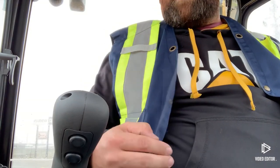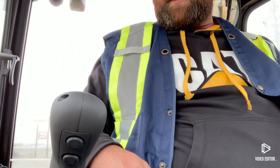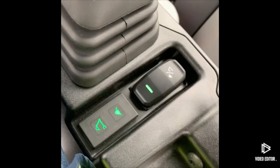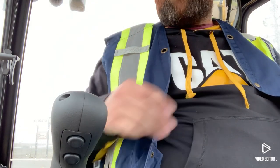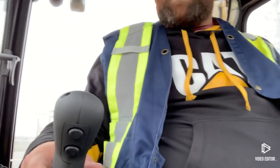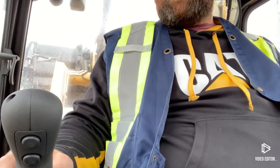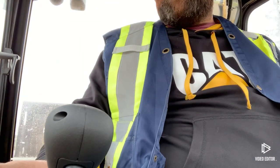I've got the camera pointed at me now and I'm going to demonstrate what dual mode looks like. I'm pressing and holding the trigger on the left hand joystick — the little loader bucket becomes illuminated, just as I showed you right beside the dual mode switch. Now while I'm facing backwards I can run my loader control as it would be if I was facing forward. I can bring my loader up — you can just see it behind me in the window — I can dump, I can curl, and I can go back down, all while facing backwards.